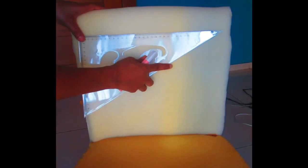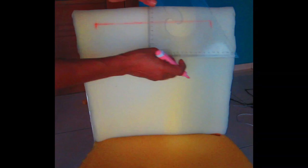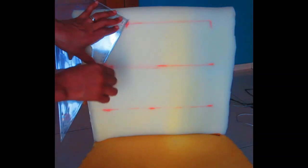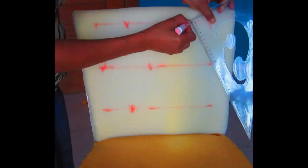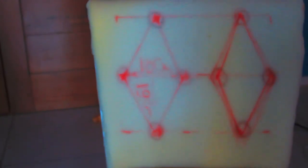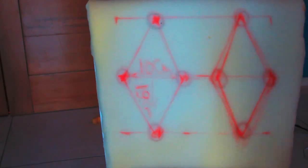Now for the tufting part — because of the way the back of the chair is made with those four bars, we don't have many options, so I'm going to do two big diamond tufts, making sure each button falls exactly where the wood bar is. The diamond tufting is about 10 centimeters across and 19 centimeters up and down.